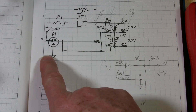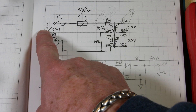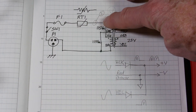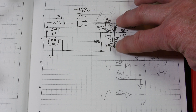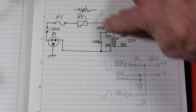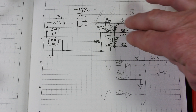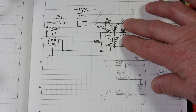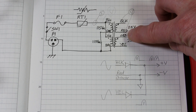All right, back to our power supply. Input power cord, the switch, the fuse, the thermistor, into our primary circuit. This transformer has two secondaries. So that's our primary loop, that's our current loop on the primary. On the secondary, we have two windings, and they're labeled black, red, orange, yellow.